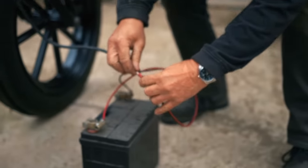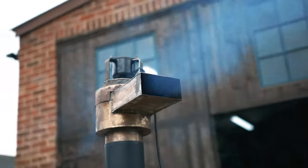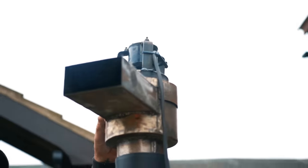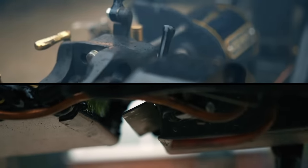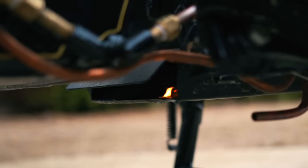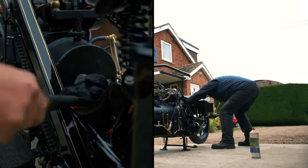Shut that now. Now we need to put the steam raising blower on, which draws the fire through. This is something I made out of a Morris 1000 heating fan. And then I need to open this, which is up to the damper flap at the bottom, and just like a normal fire. So we'll leave those sticks to burn away merrily, and when they're going well, we'll put some coal on.